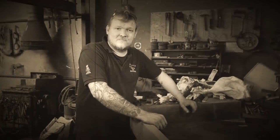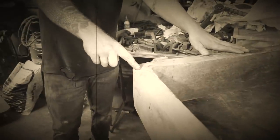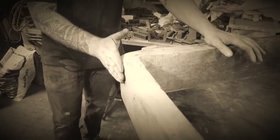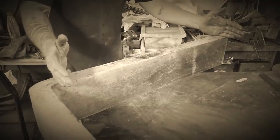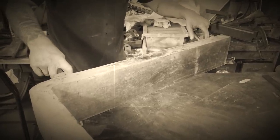Now let's talk about butchering the beast — how to dissect your tine if you find one. This piece here is called the tine or the tip, sometimes referred to as the fork. It's pointy and tapered in length, varying from tine to tine. This here is the heel — you can guarantee this part is the bit that's worn away and not very valuable if you're going to chop up these sections. Then here we come to the saddle — the saddle is pretty much the best part. And these are the yokes or hooks; this holds it to the machine.